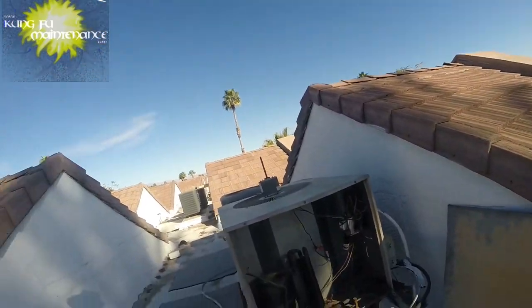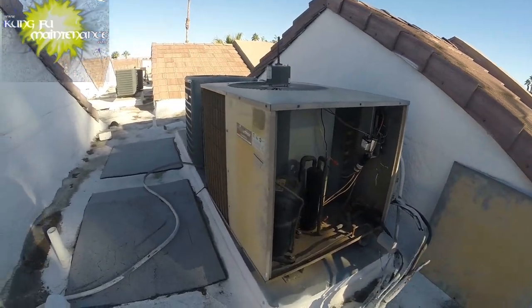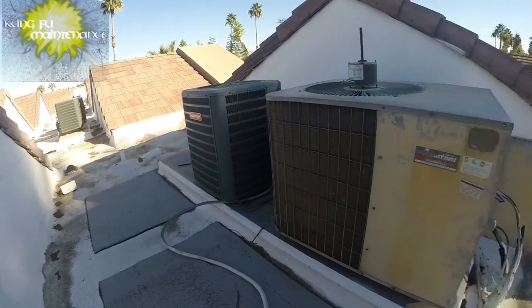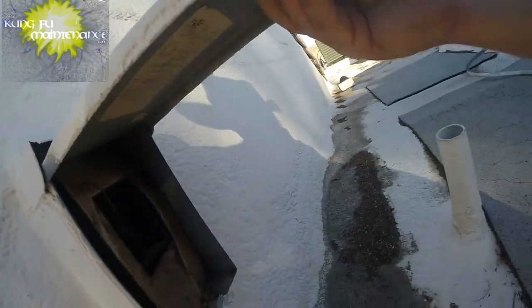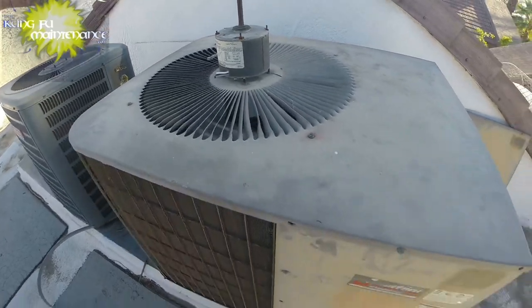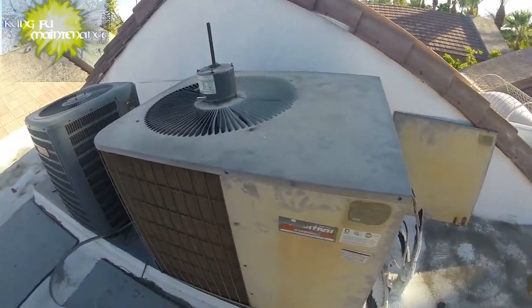Might try to recover a few fan blades from other units. I pulled the disconnect last night. Plug it in and see if maybe the heat sensor went down, but I'm going to need to replace it either way, so it doesn't matter. I'm just curious whether it went out on a thermal, more for my own curiosity's sake. Here goes. Yeah. So it looks like this one, bouncing around, the fan motor just quit. It may have a bad bearing, whatnot.